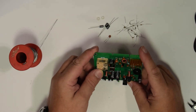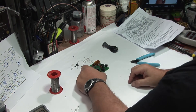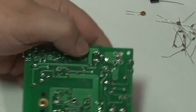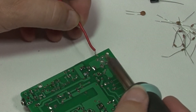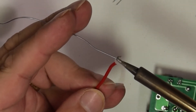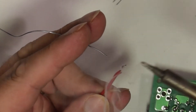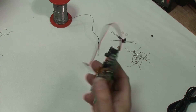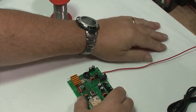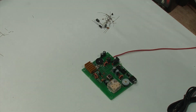So this officially is our transmitter, and it'll be a case of seeing exactly what it does when we stick some electrical trickery up its antenna connection. Need an aerial — a piece of wire will do. That will just tack on to here. If I tin it first it might help. Let's just put a blob of solder on the aerial point — that's the antenna. Now, it's really not the ideal antenna for this; you'd need something about nine feet long, but I haven't got one of them.